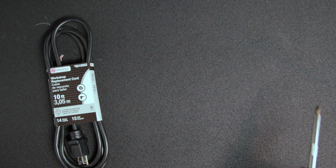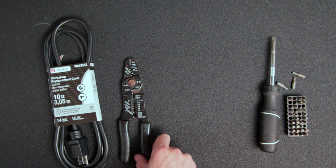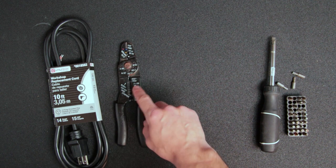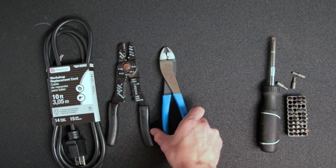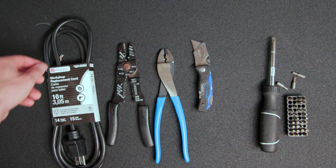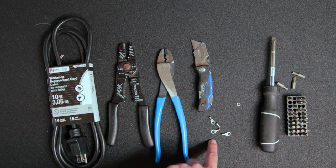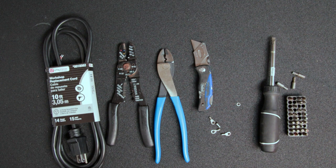Now that you have your power cord — as you can see, it's rated for 15 amps, just like my power tool — what else do you need? Every tool is different in the way it's secured: some use Phillips heads, some use Allen keys, some use Torx bits. I have this interchangeable screwdriver with different bits. You'll also need wire strippers and a crimper — these wire strippers have crimpers built in, but I prefer a dedicated crimper for crimping the fittings. You'll also need a utility knife to cut back the outer insulation. I opened the handle beforehand and picked up crimp connectors for 14- to 16-gauge wire.